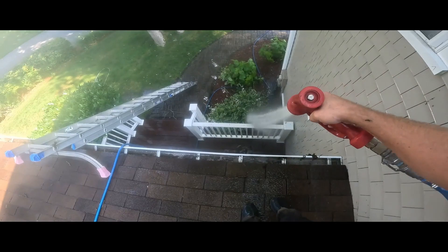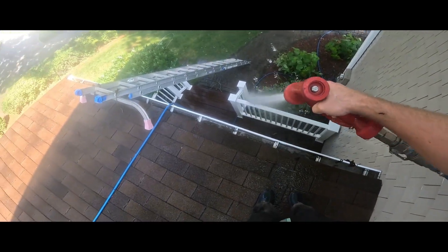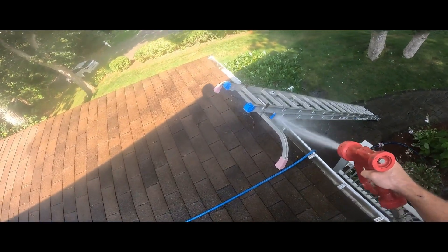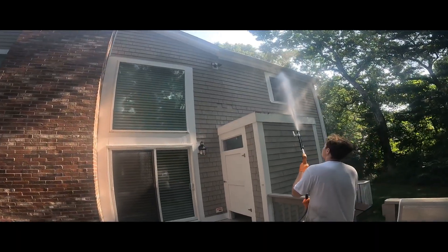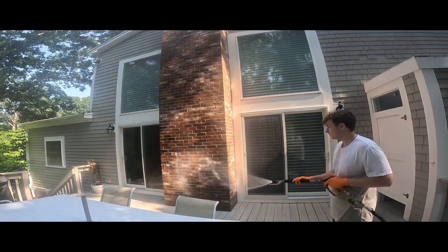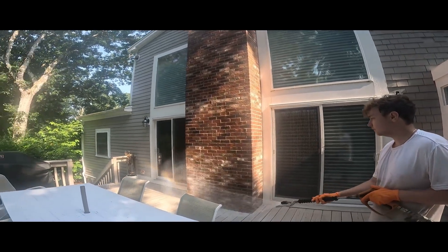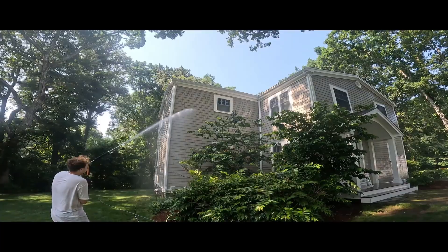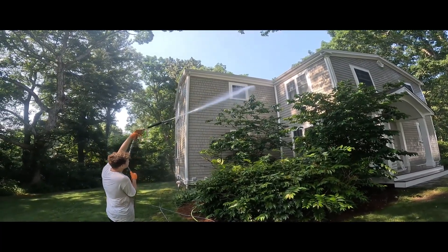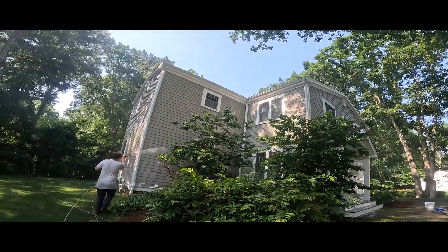This is my technique, guys. I love it. Either use this red gun on a gas roof pump or a booster pump like this, or use an 8-10 gallon per minute pressure washer with an x-jet or a shooter tip — both do great for blasting out gutters. The x-jet is going to give you a little bit more power, but if you don't need the power, the shooter tip is great. You can see Callum right there using a shooter tip cleaning up some siding — perfect.